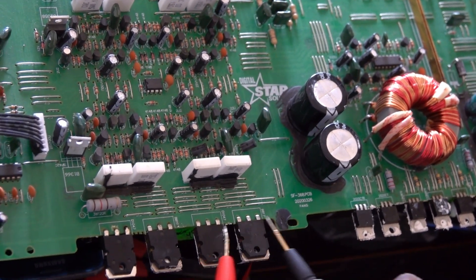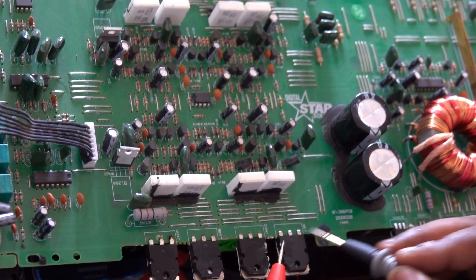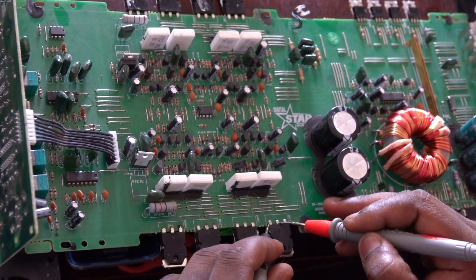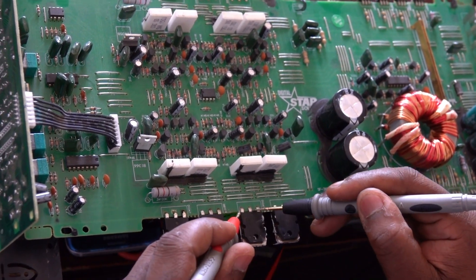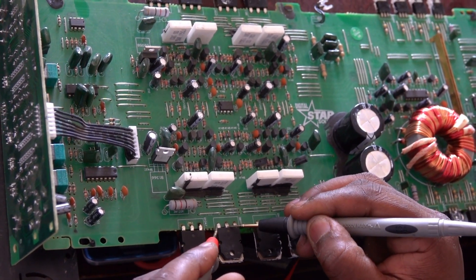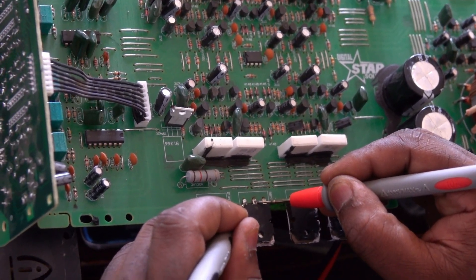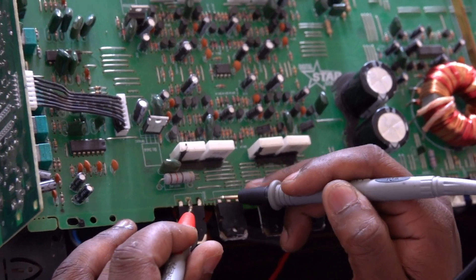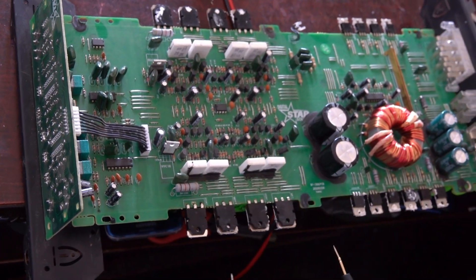They work PNP and NPN - that's why two are connected to one and two are connected to the other output channel for the speakers. The PNP and NPN work together to smooth the sound. When checking, for PNP you use the positive probe in the middle, for NPN you use the negative probe in the middle. Here this one reads 0.473 which is good - PNP, and this last one is NPN so I put the black lead in the middle.